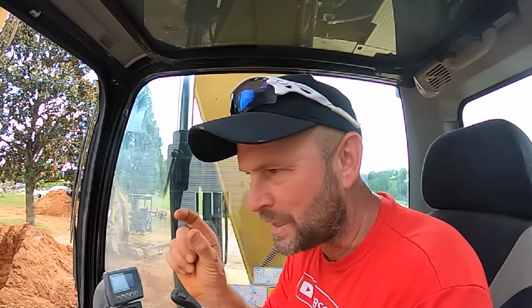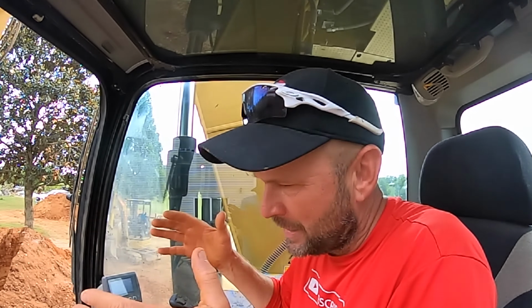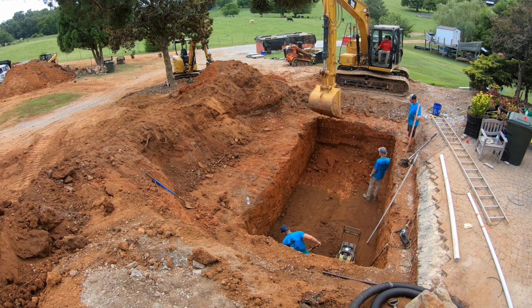When I get down to a 3 inch gap, you end up with air spaces all the way around, and what really makes those aqua blocks strong, it gives them all their strength, is having that perfect backfill and the support all the way around. They have to be perfectly level on the bottom and they have to be square and backfill tight.